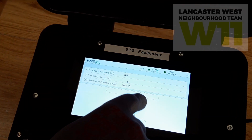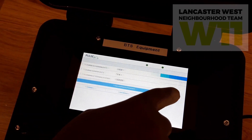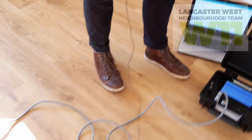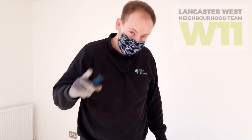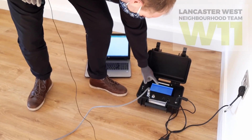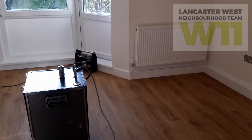Building volume is 79.4 cubic meters. Now we're ready to test. The cable is about one and a half to two meters long — try to keep the control box a good distance away from the tank unit so the air rushing out doesn't go straight at the sensors. When it launches it will be loud for just a second, so be ready. Press 'Launch' — four, three, two, one — it's about to pulse.